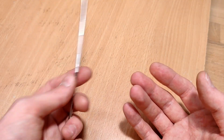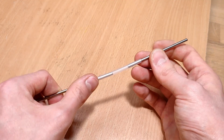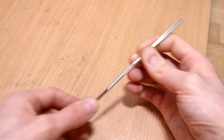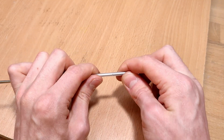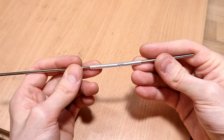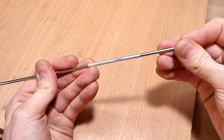But I digress. I already touted the advantage of the tube being slightly flexible, though for obvious reasons, I don't trust it to take the entire weight of the gantry. However, if I butt the ends of the shafts up against each other to transfer the load directly, there won't be any flexing possible anymore, so I put the steel balls as spacers to allow for some flexing while the arbor bears the brunt directly.